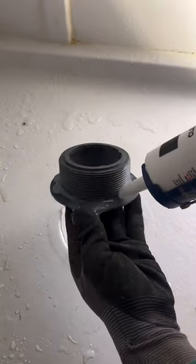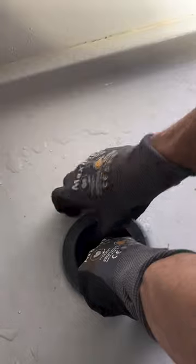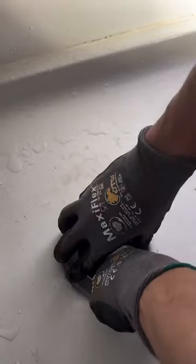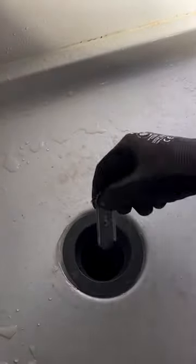I try to take what people say and use it to get better — make my job faster, easier, whatever it may be. Some people may just not know how to do that in a positive way, but hey, we're all learning. We all make mistakes, just like I did while trying to tie this shower drain in — I dipped my thumb right in the silicone, making things messy for no reason.